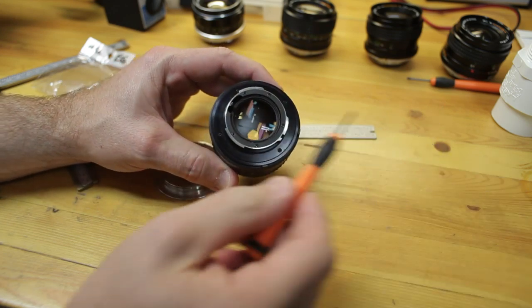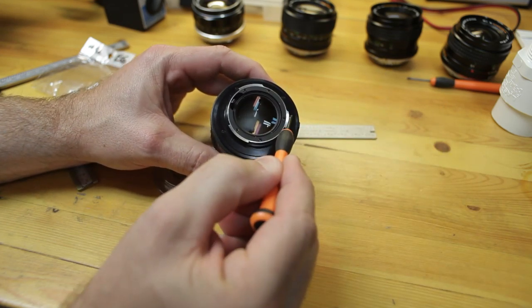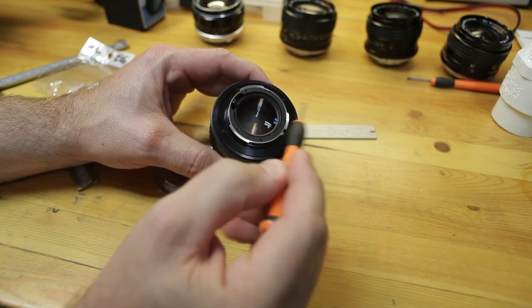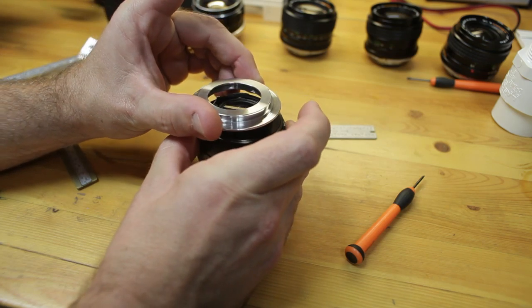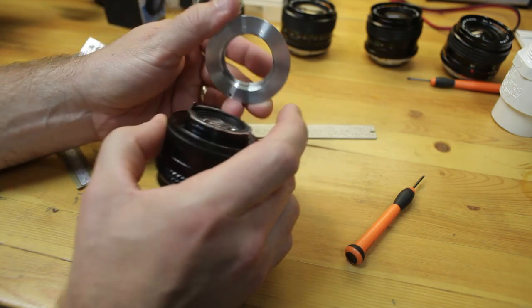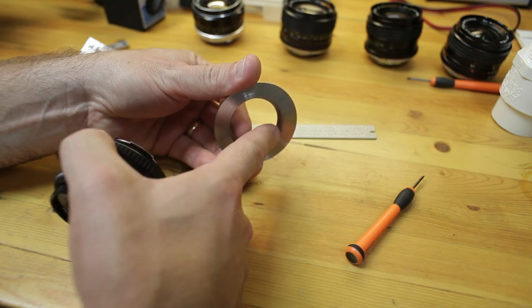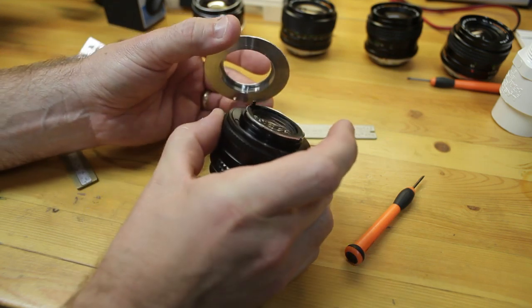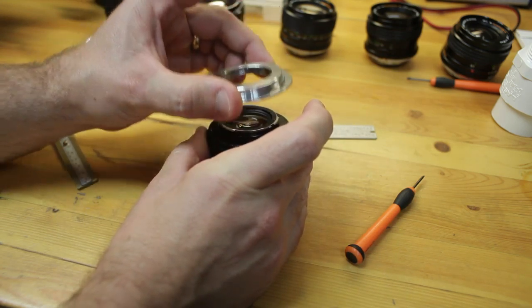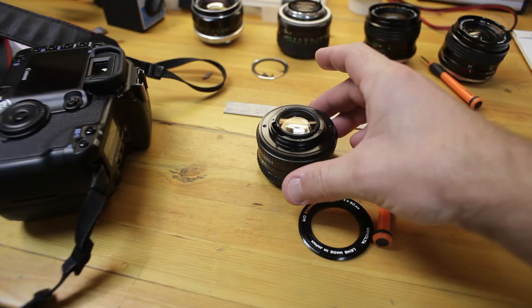To do that we're going to have to take this mount assembly off — this top portion here with these screws will come off, this silver metal flange part and this black part here. That assembly the M42 adapter still won't go over; we'll have to put this in a lathe and turn the threads, turning about two millimeters for a total of four diameter, to get this to actually fit over. Once it fits over it'll lay flat on this surface.